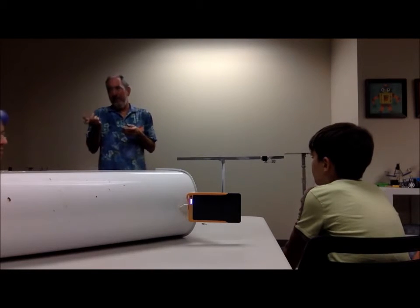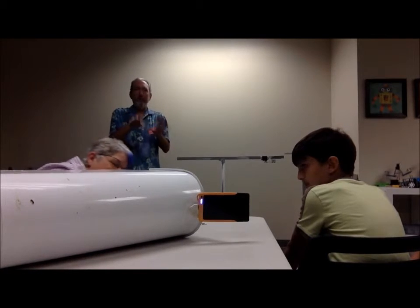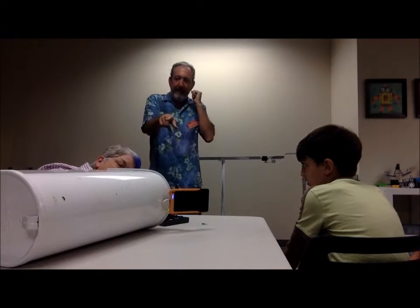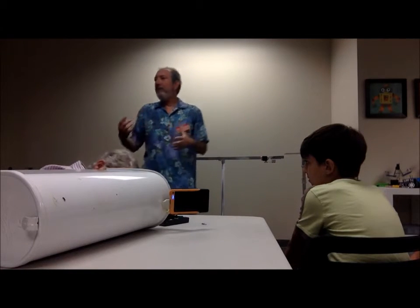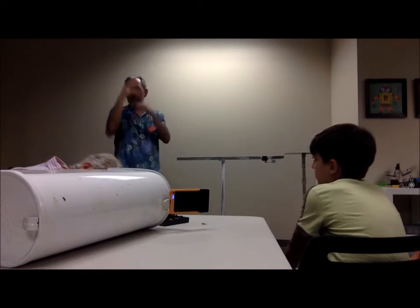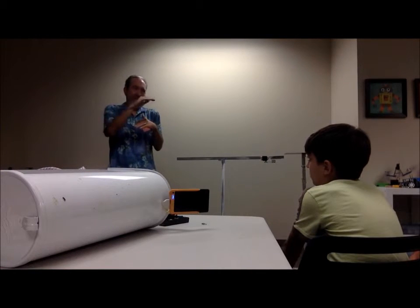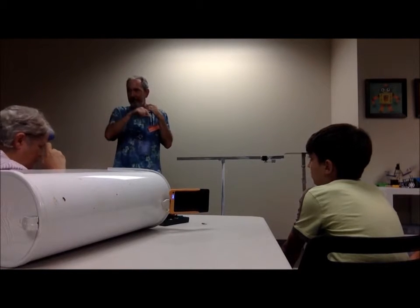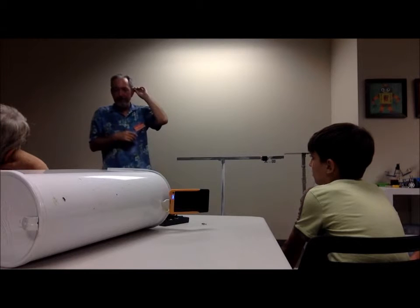Well, that's actually a really good question. So one of the other super interesting problems on this, and again, as the geek, but I don't know about you guys, is that after I got it all built, I'd have it in my living room, working on it and testing it. The light sensor gives you a value from 0 to 100, right? So you say, okay, 50. If it crosses 50, it's gone from dark to light, from closed to open.